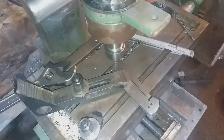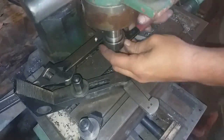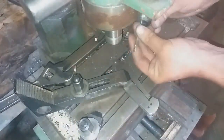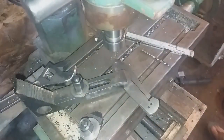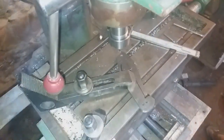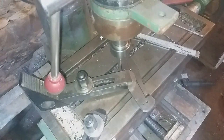I then add a little countersinking onto the lock side of the knife. In order to do this, I use a 3mm drill bit, which is what couples with the hole for the 3mm screw. I use that to realign the piece in the drill and then swap it out for the countersunk bit, so I know that when it comes down, it's going to be perfectly concentric.